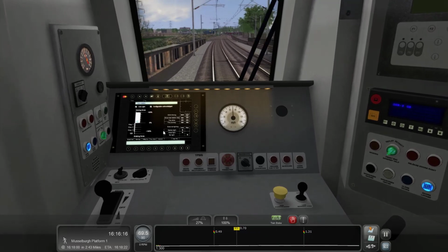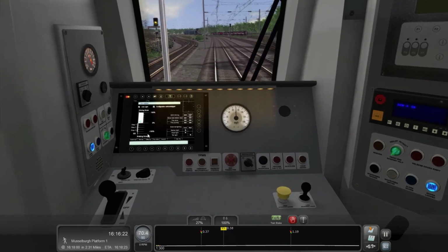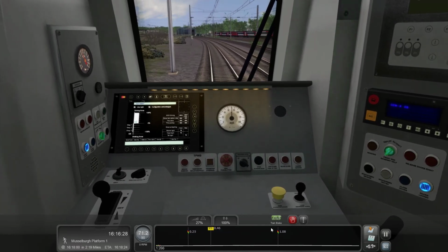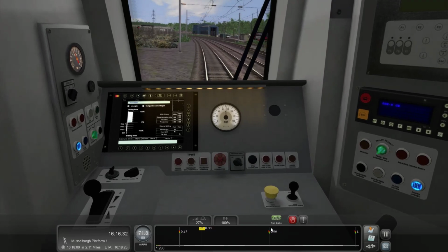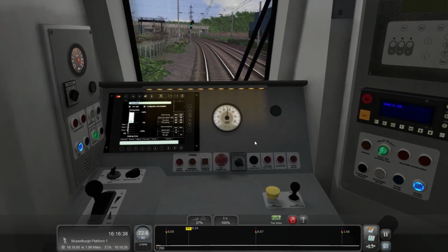Oh, the HMI, right? You'll like what this stands for. The HMI, Human Machine Interface. It's like Transformers. It's used to display diagnostic messages and to control selected train systems, e.g. driving, braking, brake system, door alarm, line voltage, current auxiliary systems and lighting. And then there is a fire alarm bypass button.